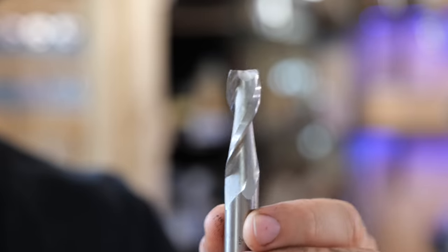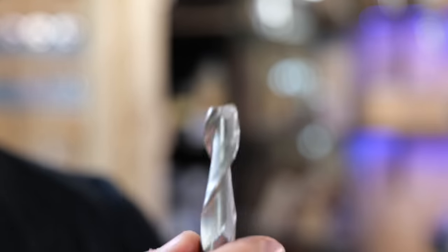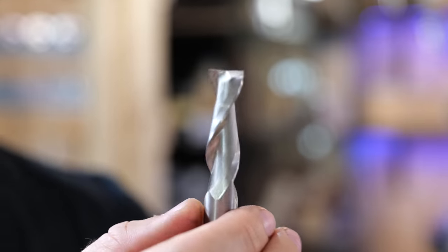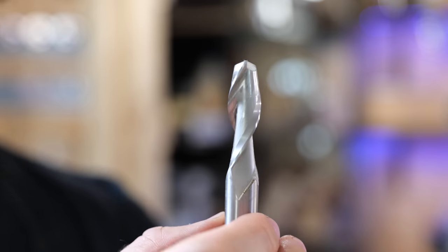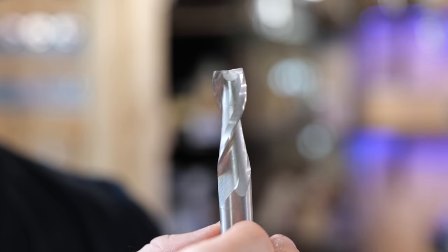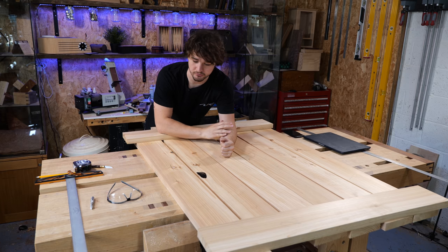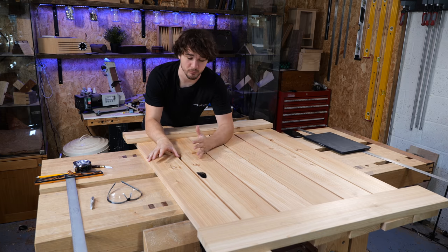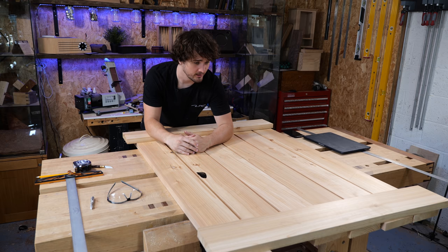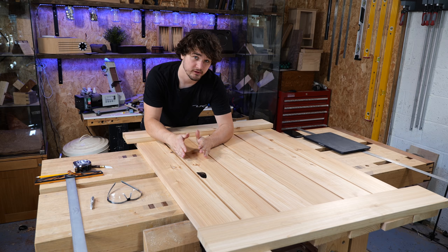When I went to Canada a few years ago I got a set of these from Lee Valley — an upcut spiral router cutter, which I purchased for the inevitable occasion when I'd do mortising with a router. Today is that day. And because the width of the slats has slightly changed since my original drawing — these were rough, so I took them from 150 down to 145 — I've got to slightly adjust the spacing while marking out these mortises.